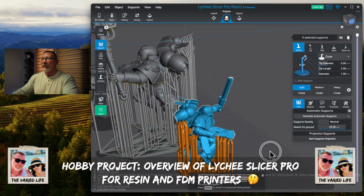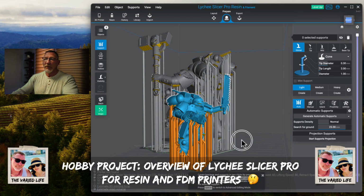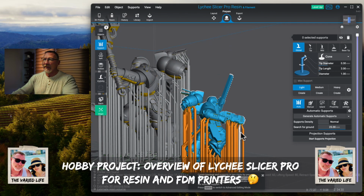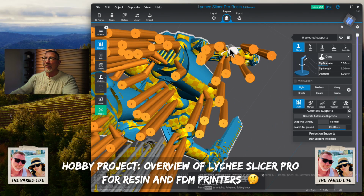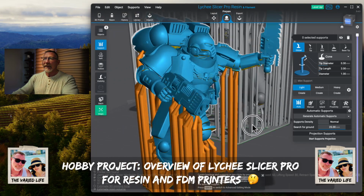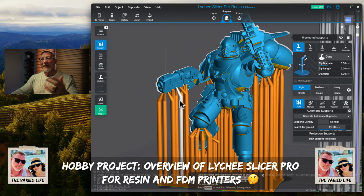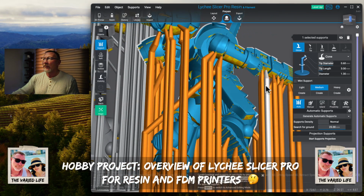So it added all of those supports on that guy, on the areas that we painted. Now that can save you a lot of time and trouble, but we notice here that there's a lot of these supports that are so close together that they could meld or weld into each other, so they're just one big solid mass. That could cause problems when you're trying to remove the supports off of this little item that you're trying to print. So again, while it could save you a lot of time, these are going to melt into each other. So maybe what I want to end up doing is changing the diameter of some of these.